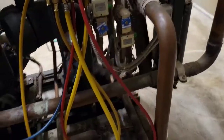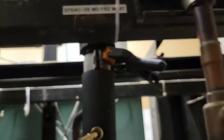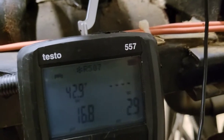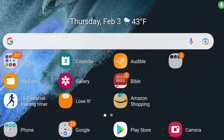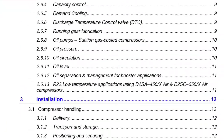Now we're going to go back to the rack. After we're done with the case, we check the superheat at the rack. This is the suction line right here — we're hooked up here, my temperature probe is snaked down in, and we can see the superheat is currently 42 degrees at the rack. So what should it be? If you go to Copeland Discus compressors — just type in Discus compressor 3D compressor service manual — go to page 27.